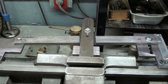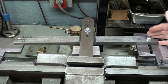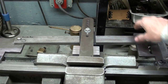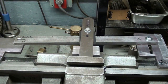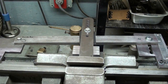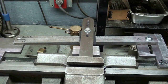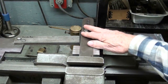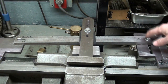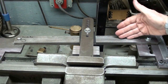My attachment is more or less a copy right out of the book of what Atlas did on their lathes. Logan did a similar taper attachment, and it swings from one end — this is the pivot — and swings on the other end. Whereas for South Bend, Sheldon, and other makes, they pivot in the center, have dovetails, and are more elaborately constructed, generally with a reading on one end in degrees and the reading on the other end in inches per foot of taper. Think of a taper attachment as nothing more than turning your lathe into a copy lathe — you're tracing or duplicating the taper that the guide bar is set at.